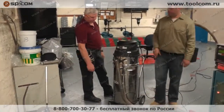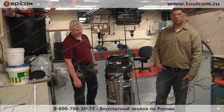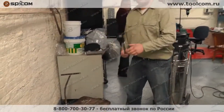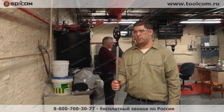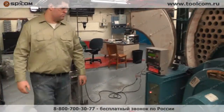You would simply hook up the boiler gun and start punching tubes. Now there's a variety of different things that you can put on the end of it. Sometimes you can use a scraper if you had some really bad scale or heavy buildup in it, but most of the time what you're going to use is a brush.